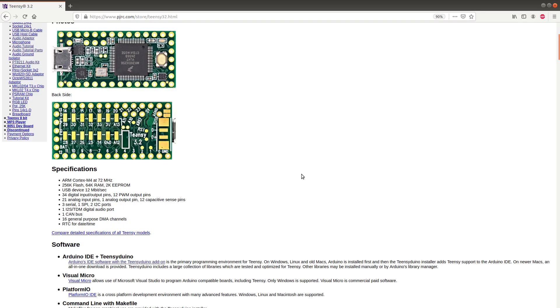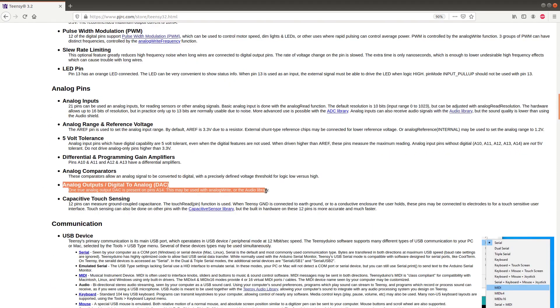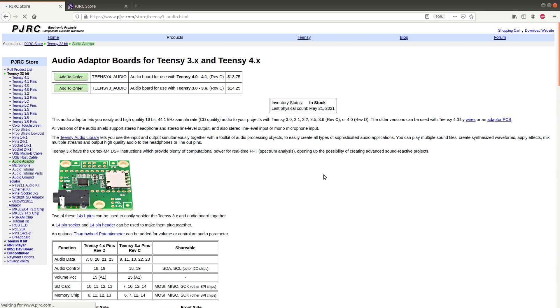So then how do these sounds get out into the world? Well, there are a couple of options. I'm using the Teensy's built-in DAC, or Digital to Analog Converter, for the audio. I decided that the official Teensy audio board is just overkill for this specific purpose. The DAC outputs 12-bit audio, which of course is not as fancy as the audio board which can output 16-bit — basically CD quality. For comparison, the classic 8-bit sound of old consoles and computers provides 16 times lower resolution than my 12-bit output. It honestly sounds great for what I'm doing and it helps to keep the electronics simple as well.